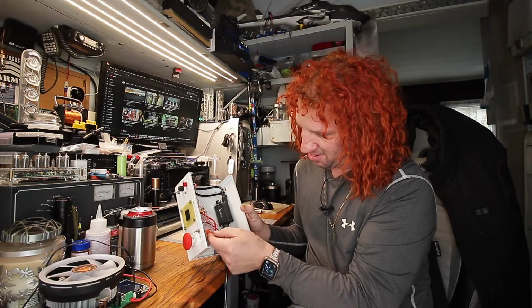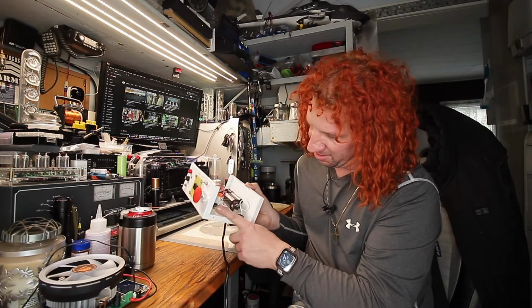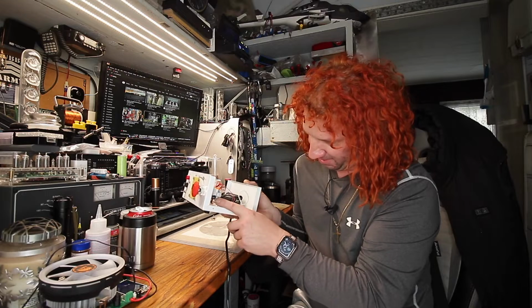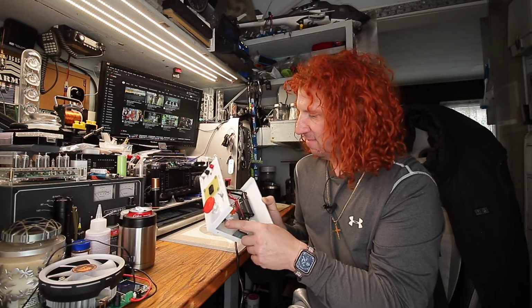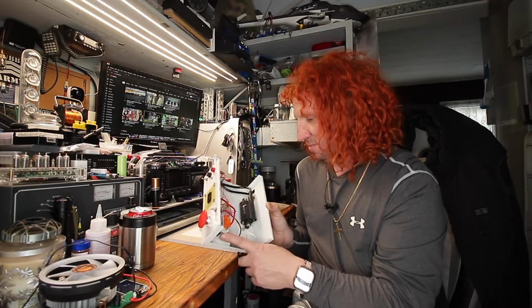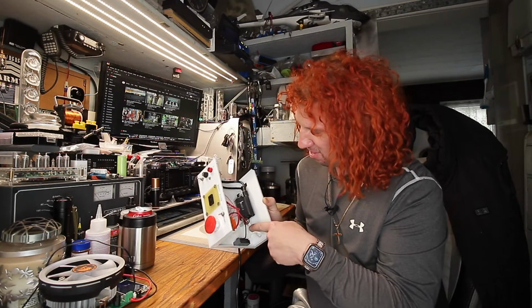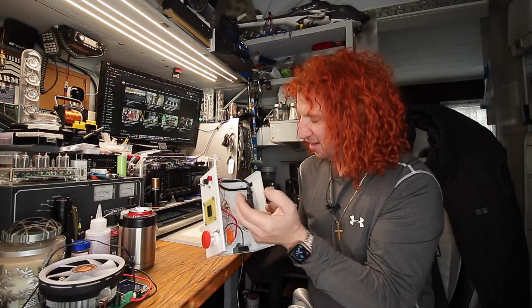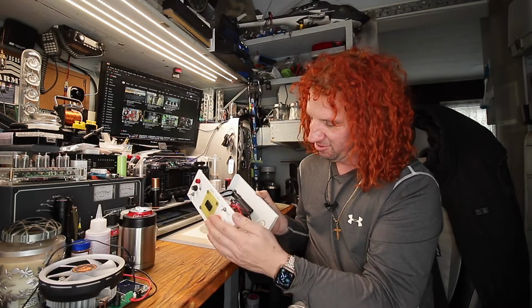Or you flip the switch, and then it goes through this diode pack here. A couple of resistors, and looks like there's another capacitor on it. And then that comes out through this, and then through this thing, through the coil. Of course, the coil has to have some kind of ground or neutral, so that goes back to the neutral line. And then all the high energy comes back around after this switch is smashed.